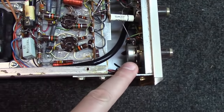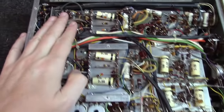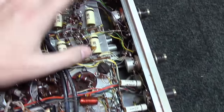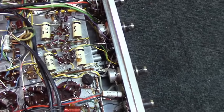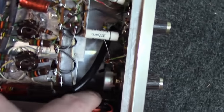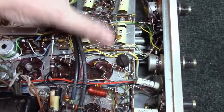So it's very important that that circuit is correct and that it's putting out the right amount of voltage, or otherwise you get some maybe runaway 7591s back here, which is not good. Or you end up with burning up the filaments here on these front end 4 tubes. So I'll pay special attention when I replace that to see, did it change the voltage designed across these?